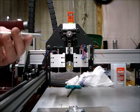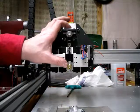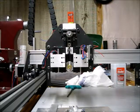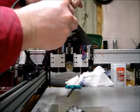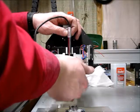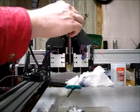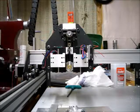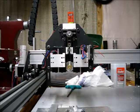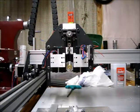Mount exploded view. So yeah, coming along. With any luck, next time I have time to work on this I'll definitely get that plate mounted in there, and with any luck I'll get the two brackets to hold the camera — including the set screw to lock the focus adjustment knob. This whole thing should end up right about there. There's no reason I can't make my mounting blocks a little taller, which would put the camera right on center line with the pick and place heads in at least one axis. Either way, I'm done for tonight — I'll pick up next time.